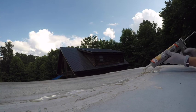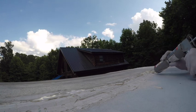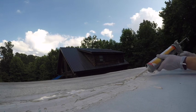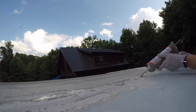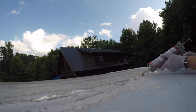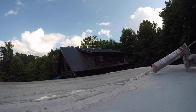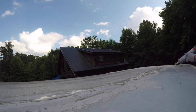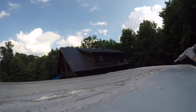This is the first time I put lap seal on the ceiling and it was really hot up there. It took a lot of hard work, but I got about 90% of the ceiling sealed and I'm very happy with most of the roof repairs. There are still some challenges — some small spots that are still leaking. I'm probably going to have to go over them with Eternabond Tape to seal them up better, as we had a couple of heavy rains that helped identify where the leaks remain.